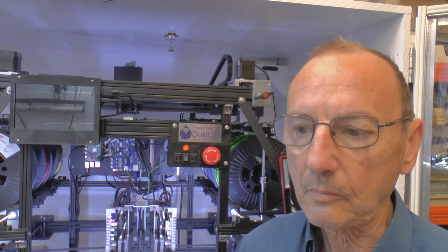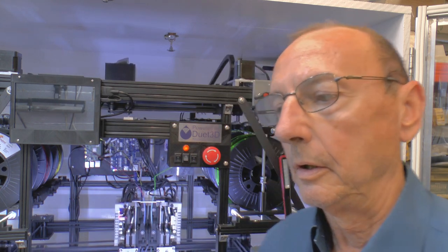because there's a lot of mass there. So I had this idea of doing a little Python script to generate G-codes that would contain UV A and B moves from a file that's just got X and Y. And then it struck me that those UV A B moves don't need to exactly match the X and Y. So I thought I could replicate this thing that I had when the extruder was passively driven, so that the short zigzags didn't rock the whole machine about, because it's only the hot end that moves and not the extruder gantry. So basically, I've written a little Python script that does that, so I can post-process a G-code file